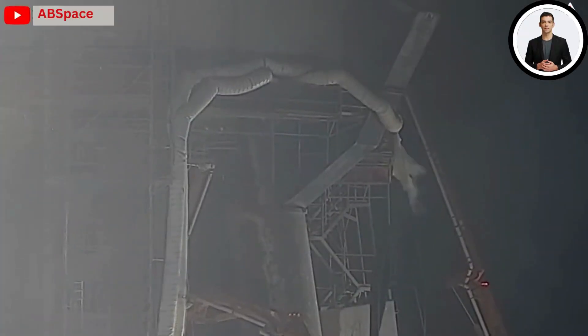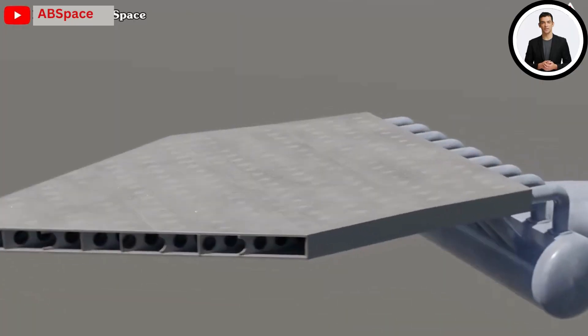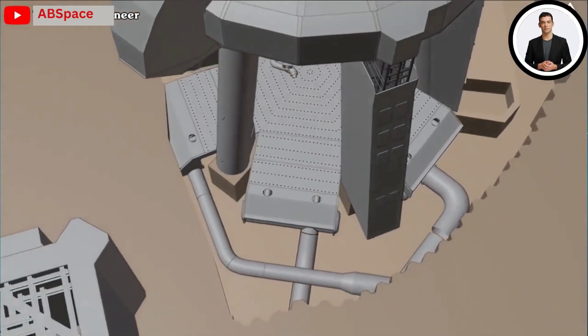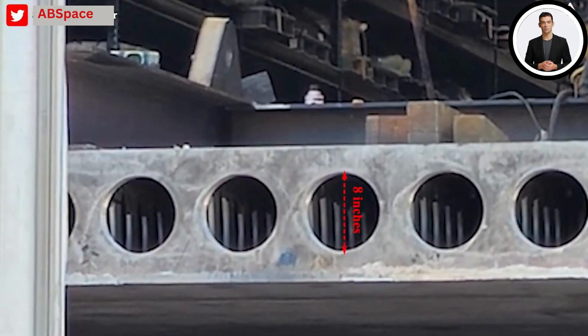The stage is now set for further progress. Alongside the arrival of the steel plates at the launch site, the necessary three manifolds were also transported and eagerly installed. Work commenced on twisting the shower head into its structure; the manifolds were carefully lowered into position and subsequently welded to the center section, resulting in the formation of a cohesive assembly.